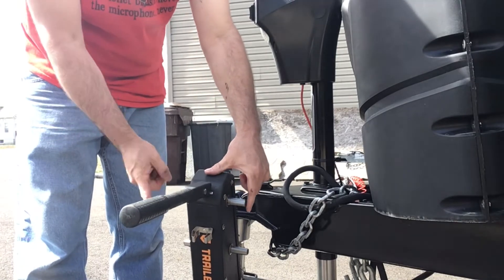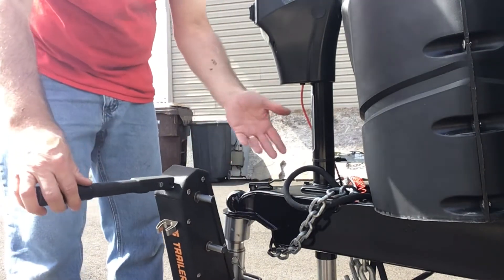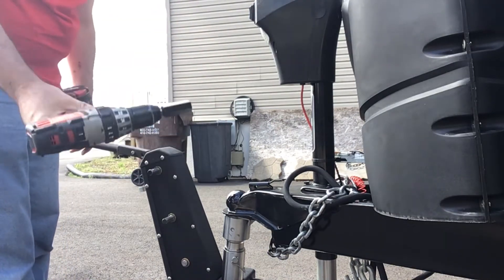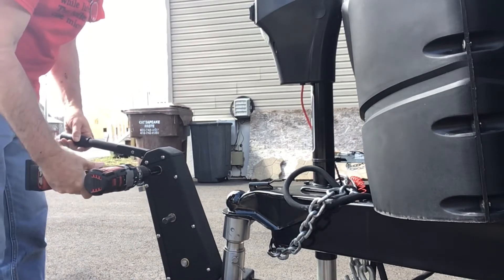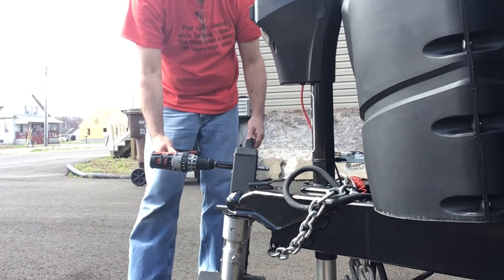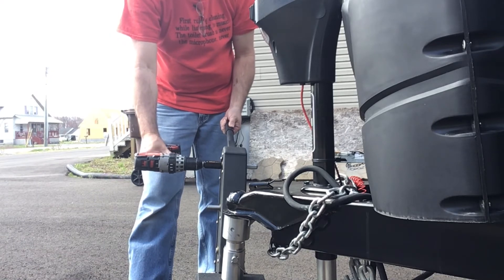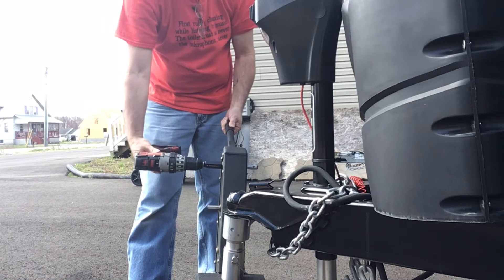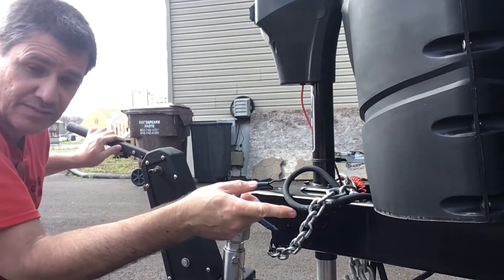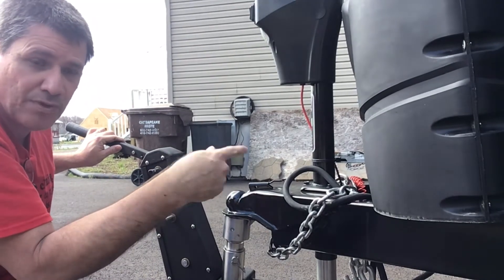You can use this on the left or right side — it has low speed and high speed. So whether you're left-handed or right-handed, you can use the crank or you can use your drill. It connects right on there and now your drill is your motor. You go forwards — switch it on your drill — go backwards. Works nice. Just remember: stop the drill first, then apply your brake. Because if you're drilling and you apply the brake, that drill is going to whip around and it's going to break your wrist. So be very careful — become familiar with this.